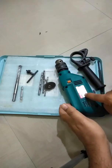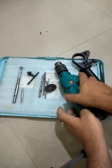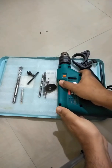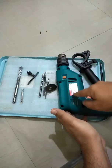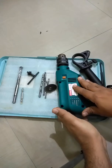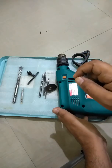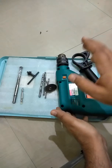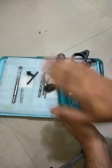The third tip is power. This machine has 400 watts, and power is important to generate torque. When your drilling machine gets stuck, is it able to move itself? If it has less power, it won't. You should aim for somewhere close to 400 watts or above. I explored Amazon and found a Black & Decker product covering all these tips — it supports 550 watts and generates 4.5 Newton meters of torque. Higher torque is better; don't compromise on torque.